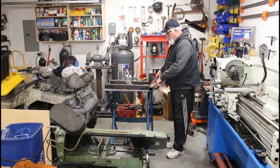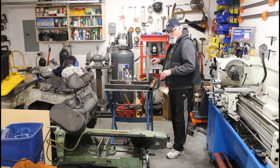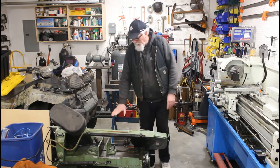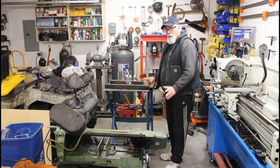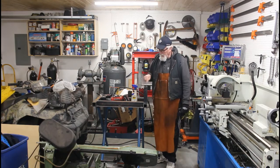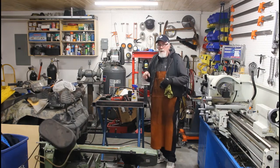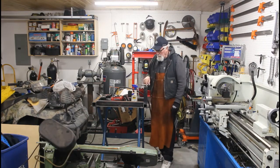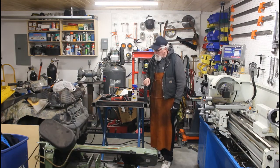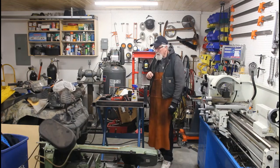So I'm just going to tack the frame up, tack the wheels on, and then I'm going to double measure the height with the wheels on and everything to the cutting surface. So stay tuned. So I'm just cutting the upright square pieces now. Then I'll tack them in place, and then I'm going to cut the angle iron frame that the base of the saw will sit in. So I'll just cut three more of these, at 8 inches, and then I will dig up the angle iron and make an angle iron frame. So that's the next step.